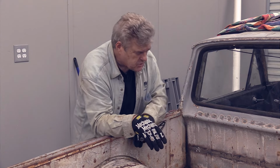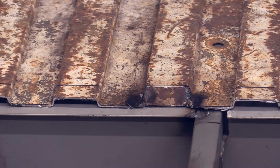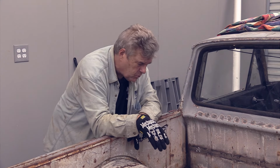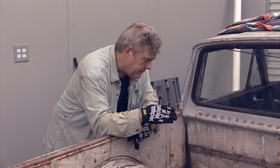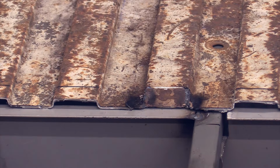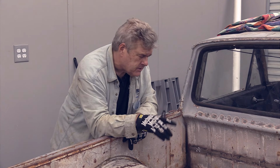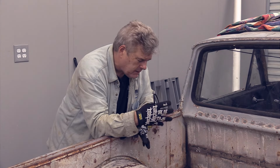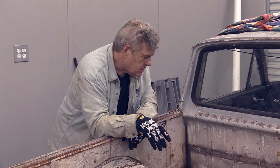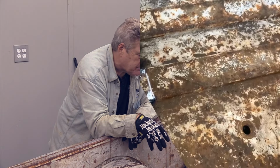I've learned off of the first one because this one I didn't cut these edges back immediately, and I probably should have with my grinder. I should have just cut them smooth, and then that way they would be in good shape. I also have a blow through right here, which I'll need to repair. But the rest of these should go along just about like that one does. And I'm hoping that with this, it'll also make that plate a lot more stable whenever I'm using it. So I'm going to pull this out, go and work them, and then we'll close this thing out.